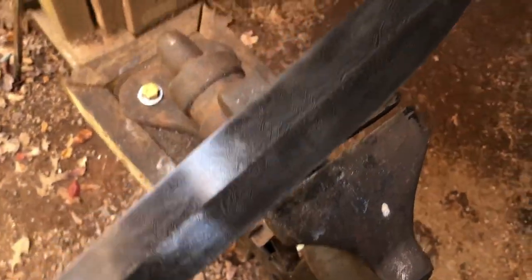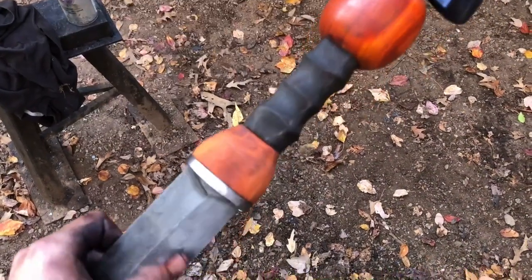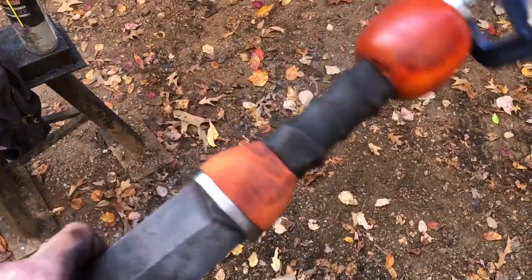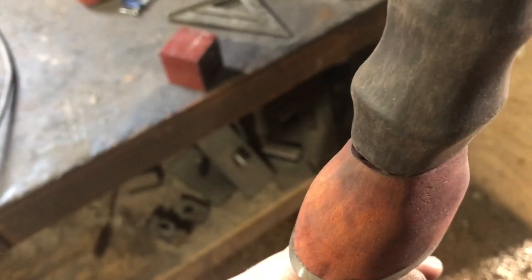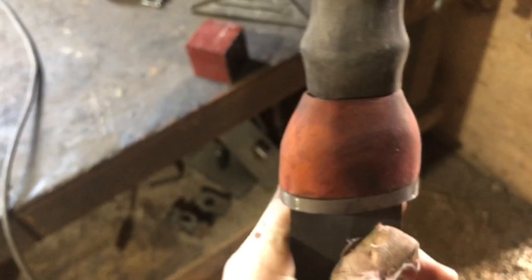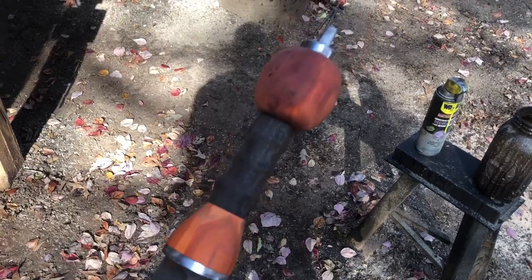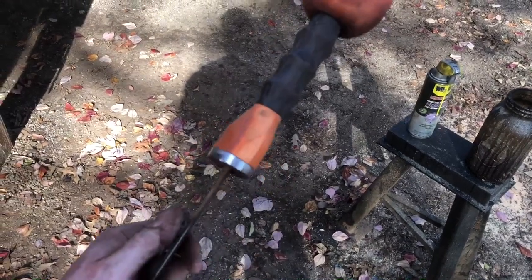Got the hilt mocked up, held on with a little clamp. I'll go through and hand sand all the fittings, contour everything so it all looks nice and fits together, take it apart, do the file work on the fittings, blacken them, then give the sword the acid bath — and we're ready for final assembly. Moving along getting the handle pieces sanded down. The two pieces aren't flush yet and there's a slot cut mark that would be exposed if we keep sanding. So we're going to remake this bolster piece. Spared you that pain — it's done, handle's mocked up and looking good.